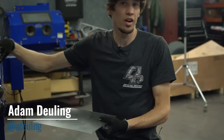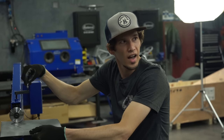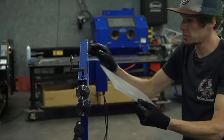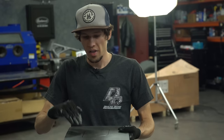I was putting very little pressure down, coming down with this, and you can feel that contact there. The biggest question everybody gets is how do you keep the oil can down. You adjust your die depth, make it wider or skinnier depending on what you're doing, and then you just keep adding to that. You want to keep that pressure minimum and go over it and over it, and do all your features at once.